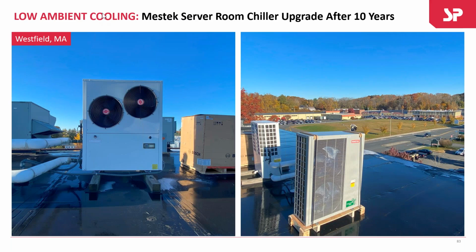This is actually the top of the roof of the building that we're currently in right now. The picture on the left shows the previous version. I hate saying old, because I'm old, but the previous version of the very first air-to-water heat pump we offered in North America, the SCM060. That is what is replaced with what you can see here on the right, the new inverter SIM060 version. This is the unit that we use for our low ambient cooling. Okay.